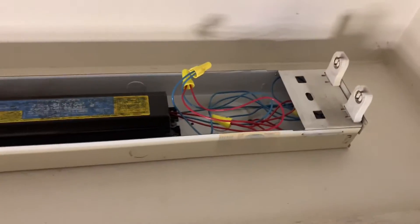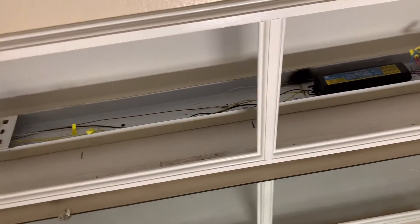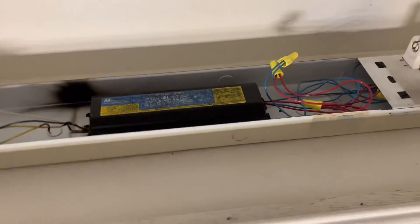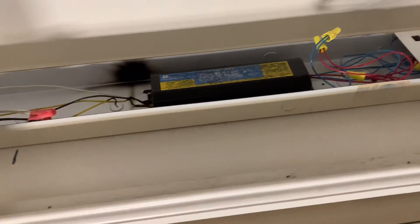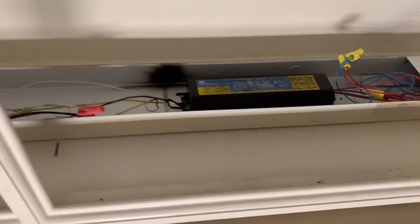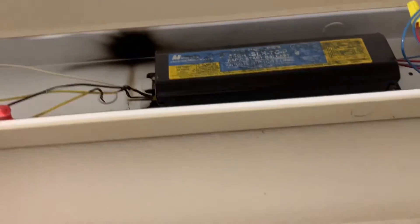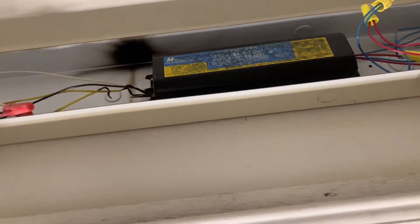You should always make sure you replace your bulbs correctly — replacing just one bulb at a time can affect these fluorescent light fixtures, especially with a ballast that's old and can go bad. You should replace both bulbs at the same time. I highly recommend replacing two bulbs, not one. This happened to me after I replaced just one light bulb and it broke my ballast.